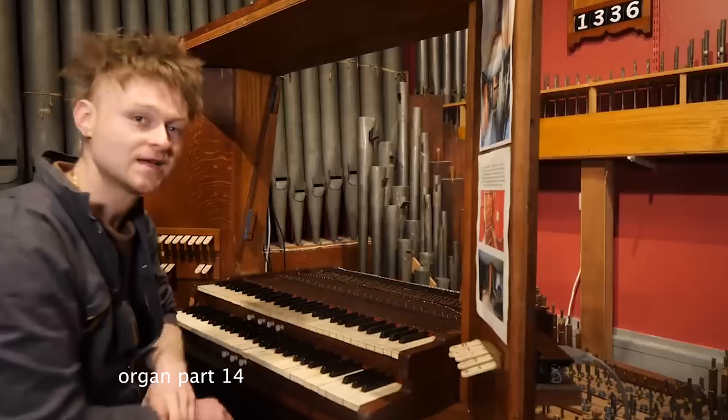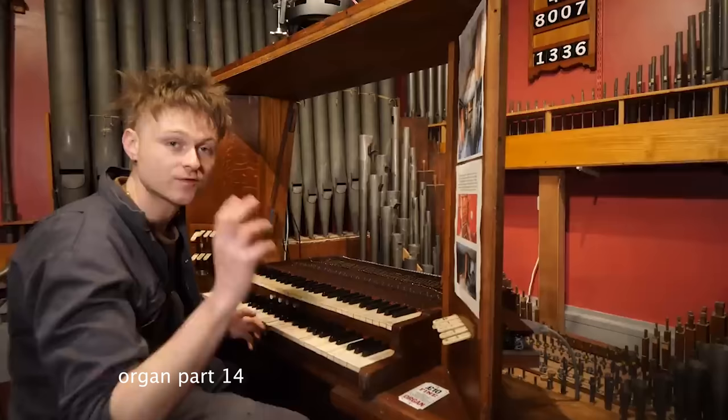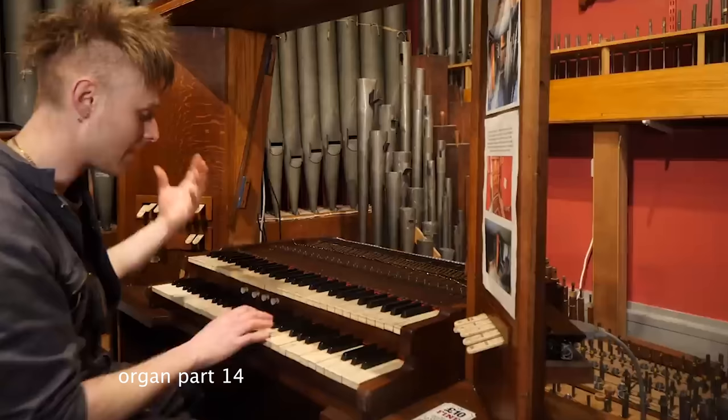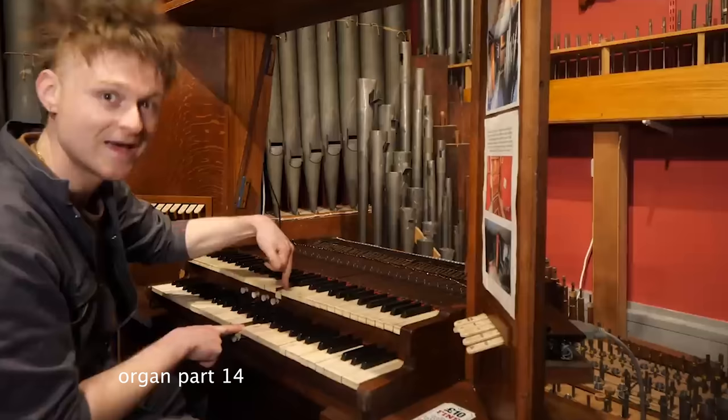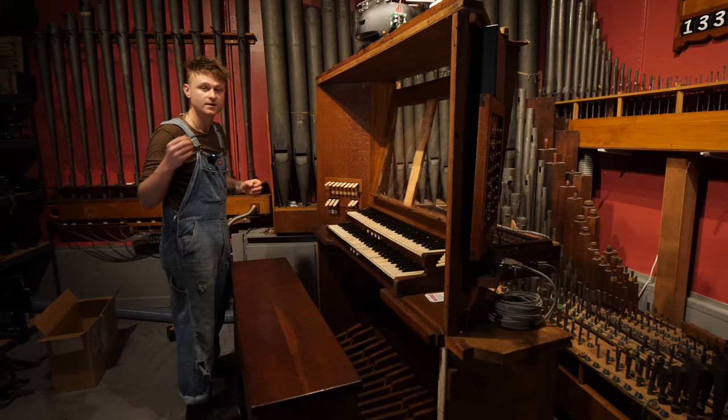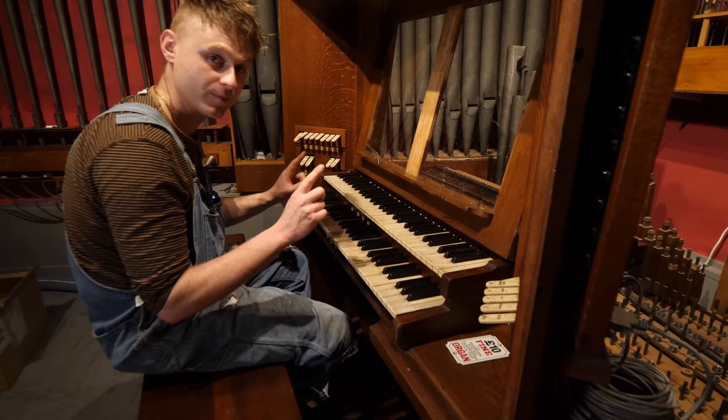Now this is the issue that I haven't sorted out in the code yet. The problem is with what I said about MIDI, it sends MIDI note on and MIDI note off commands. That means when I push it down on here, this MIDI note is exactly the same as this one right here. The problem is if I play this one here, my finger's down on this key, I play this one, and I take my finger off this top key, it stops and my finger's still playing this. So yeah, if you remember, it was a very simple piece of code and it certainly had some drawbacks. But now, today, let's see if this problem is still there, shall we?